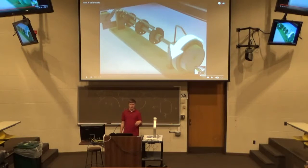You could also see why, the way it's built, sometimes if that gap is too large, you get a tolerance of, oh, you only have to be within maybe two numbers of the actual number, because as long as the bar can fit in the slot, you're good. So sometimes in really cheaply made locks, you can have a block of five, where you can go 2.5 this way, 2.5 that way, and get close enough for it to work.